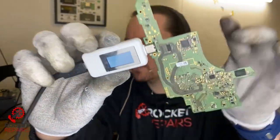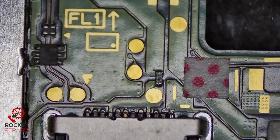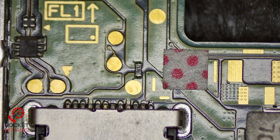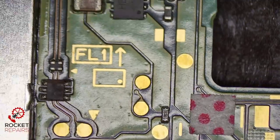Let me try the other way and see if we get the same sort of reading. Yeah, 100 milliamps — 15 volts. So let's check for any shorts that we have. First off, considering that we have checked the port and there's no damage there, we're going to start with the fuse right here. Meter in continuity mode — we're just going to see if the fuse has continuity, which it should do. Which it does. The fuse has continuity — that's good news. So the fuse is okay.